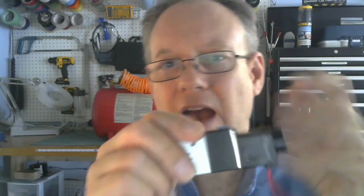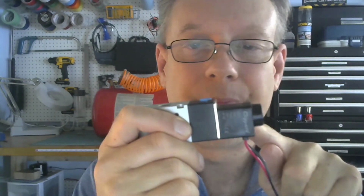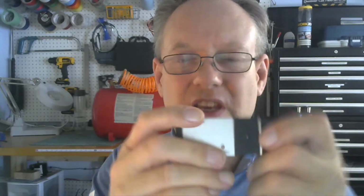Now, let's just say I wanted my cylinder to generally retract or extend whenever I'm not using it. Well, I'm not going to make it so I have to keep this guy energized the whole time to have it either extend all the time normally or retract all the time normally. I said normally, didn't I? Usually when we say normally anything, we've got a spring in it. So if there's a normal state to your cylinder, you want to hook your cylinder up to your DCV so that the spring activates it and it puts it in the normal state.